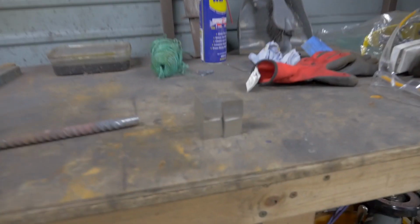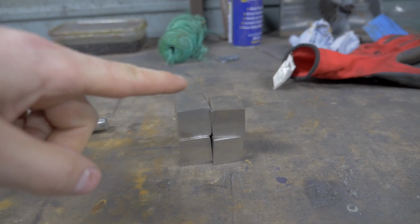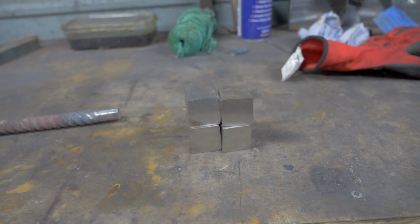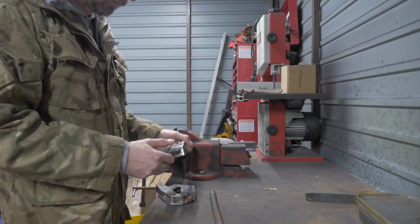Ooh, exciting. Okay, next day again. As you saw before, we've got our little pieces of Damascus here. I've made the bar ready. I'm going to weld these all together. I'm going to weld across the top, across the front, and then attach a bar to the other end. And then I'm going to put it in the forge, and then hit it on Sir Percy, and hopefully we'll make 1 billet and it should give a star effect. Let's get the welding done and let's get it back in the forge.